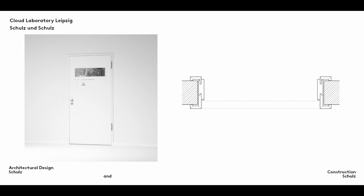Door frames differ from one another in terms of the way in which they connect to the wall opening. Double-sided frames wrap around the entire wall opening on three sides in a U-shape. They cover up irregularities and tolerances in the wall surface in the area around the opening. As double-sided frames are larger than the opening they surround, they comprise several components that can be fitted separately into the opening. Most doors are constructed using double-sided frames.